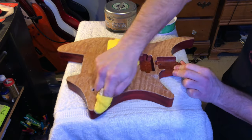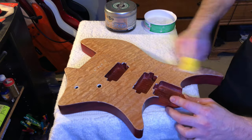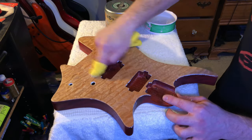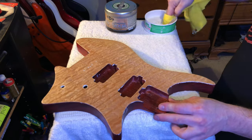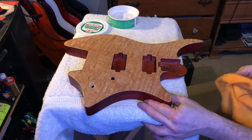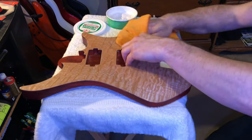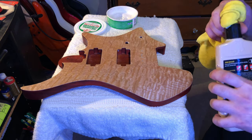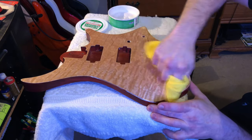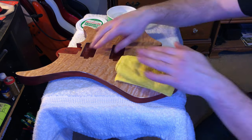A little tip: if you apply your last few coats of poly pretty thick and let it level off, it will level off pretty smooth and give you a great starting point. Let it dry a good while — about a week or even more — then you can wet sand it and start buffing. I wet sanded it lightly just to knock down any rough spots and get a nice smooth finish. Even where those wrinkles were in the wood, you can still see them just from discoloration, but you cannot feel them — it's like a piece of glass right over it.